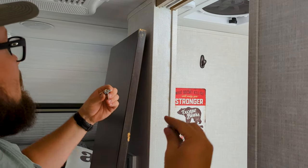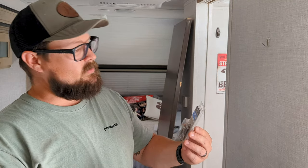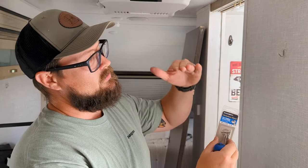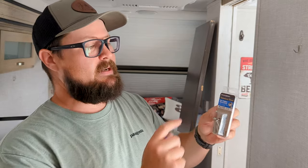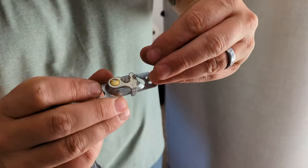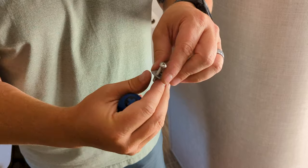Once we get these off, we're just going to put these back on top of the door, screw those in, and hopefully that's all we have to do. We have our screws — we're using pan-head Phillips. You want to use the pan-head because you want it to be flat where it rests on that bracket up there. These are number 10 size, inch and a half long. We have four of these. They fit through the hole, which is important, just barely.